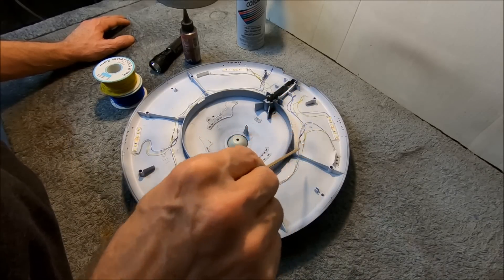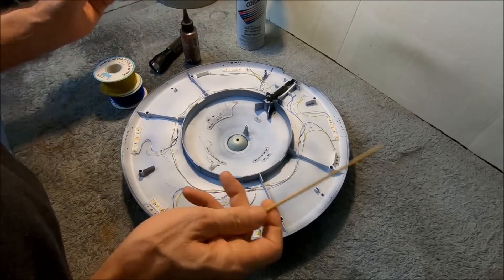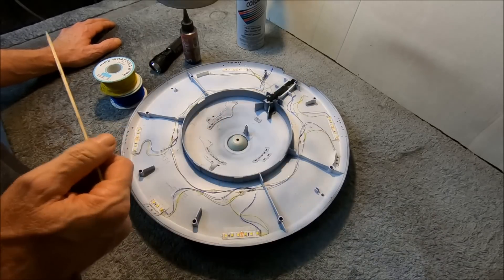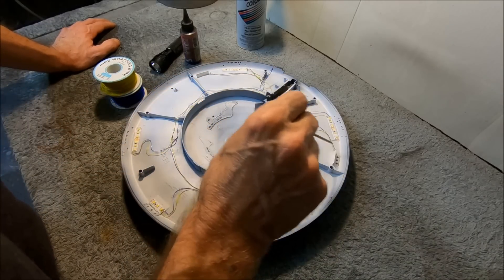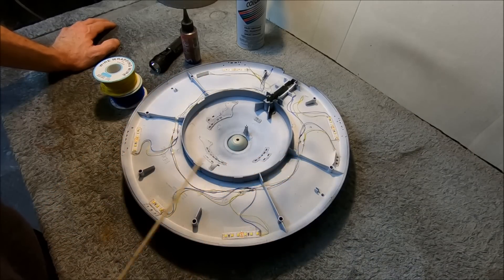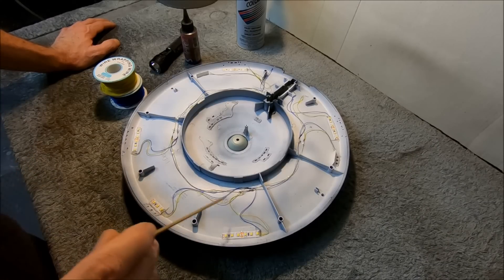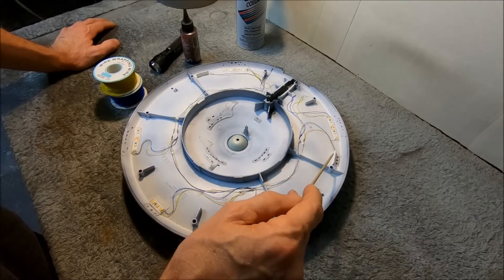What I do here is start off with a circle of wire all the way around — I just cut off two equal strips, a little over a foot long, maybe about a foot and a half. It goes all the way around and I CA glue it down about every four inches or so. Then I've got my basis for my power hub — I call it a power hub — and I can come off any area I want and connect power to it. Once I get that all in place, I start putting in my individual LED strips, get those all glued down. I solder two wires onto each one, making sure I got the polarity correct, and I test light each one of them before I glue it in. Then I tap into each one of these little spots wherever I need to.